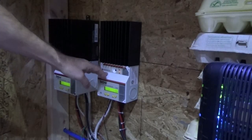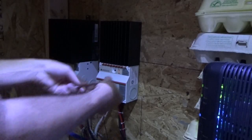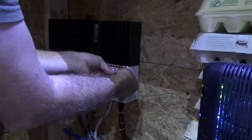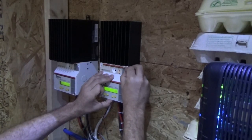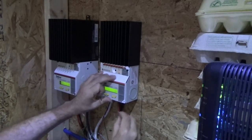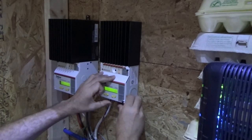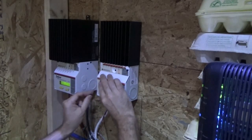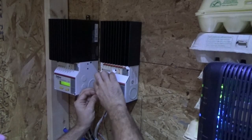I do have an alarm, and that's because this is a PWM controller - the over-voltage is coming from the solar panels. So I'm going to be putting 12-volt solar panels on this instead of the 24-volt panel, and switching things over outdoors as well. I am getting an over-voltage warning with the higher-voltage solar panels. The charge controller is taking it and functioning, but it does have an over-voltage alarm. That's something you guys can learn from my miscalculation.